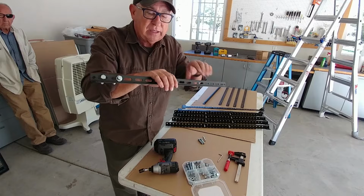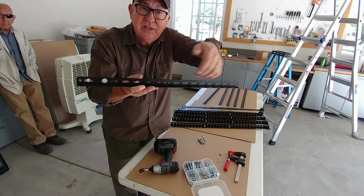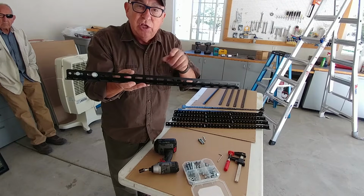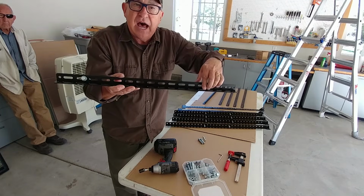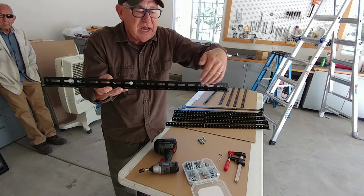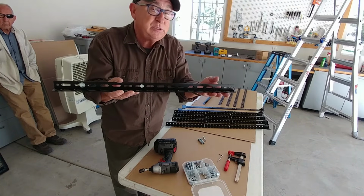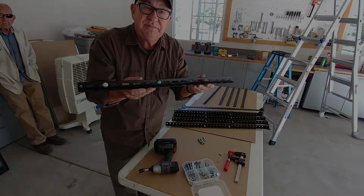One other thing very quickly. You want to make sure that the down rod, which is going to be attached to this, if this backside facing me was to the ceiling, you always want to make sure there's a bolt on both sides of that down rod. Never gang up the bolts on one side with it going over here. That'll lead to failure ultimately, or at least bending the hardware. All right, let's go ahead and get these attached to the ceiling.